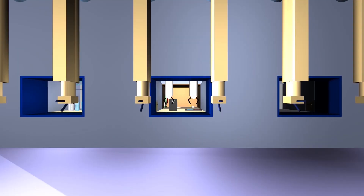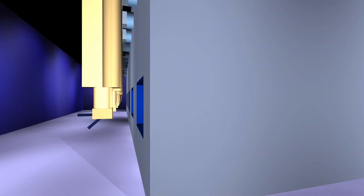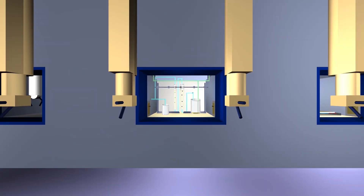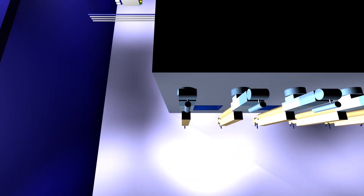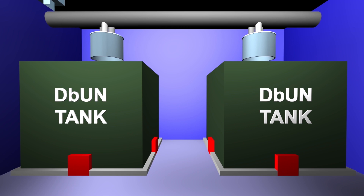We'll be down-blending it further by circulating pre-made depleted uranyl nitrate through piping in the hot cells. This circulation generates pressure that will suck the uranyl nitrate out of the hot cell into the recirculation system and through to the waste tanks in another area of Building 2026, where the depleted uranyl nitrate originated. Adding processing waste to the depleted uranyl nitrate creates down-blended uranyl nitrate.